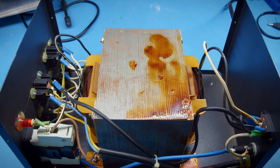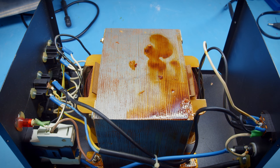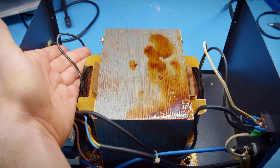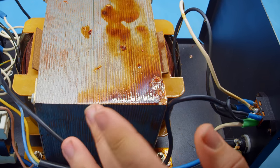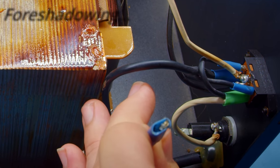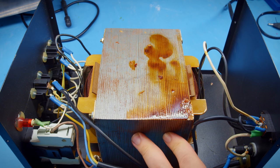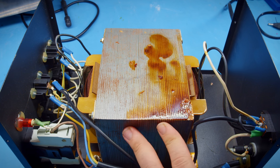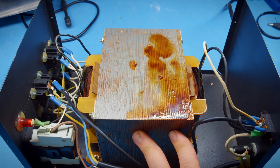This device will either take 240 volts, cut it in half, and output 120, or take in 120, double it, and output 240. That made me think this would be a two-to-one transformer with two windings where one is twice as long as the other — but it doesn't work that way. This transformer has three wires connected to it. I had never seen that before, and just finding out this even existed is what prompted me to make a video on it. That just broke off of the fuse — it's a good thing I was planning on looking at all the wires anyway.